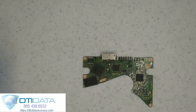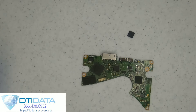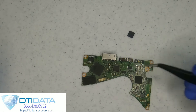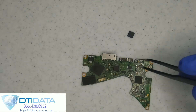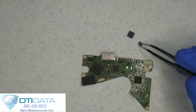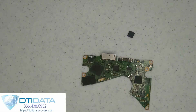I'm back, and what an interesting journey that was. I successfully replaced the USB bridge — this is the new one here. Upon replacing that component, the chip to the right just here would overheat; it was impossible to touch, it was that hot. So I ended up replacing that component as well.